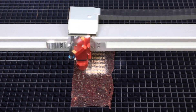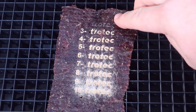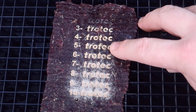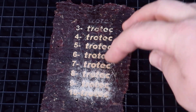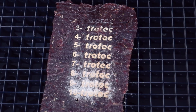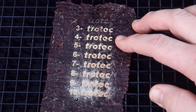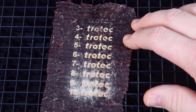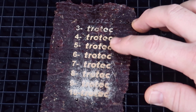At 90% — considerably more laser power. Wow, interesting. Now 100% laser power onto the surface of beef jerky. Here's a closer shot: right around 10% didn't perform at all; 20 through 60% we start getting interesting results; 70-80% brought dust and debris; 90-100% is definitely too much power. So it looks like my best power setting is approximately 40 to 50% — not too much residue, nice and clean, great contrast. Something I would not have expected.